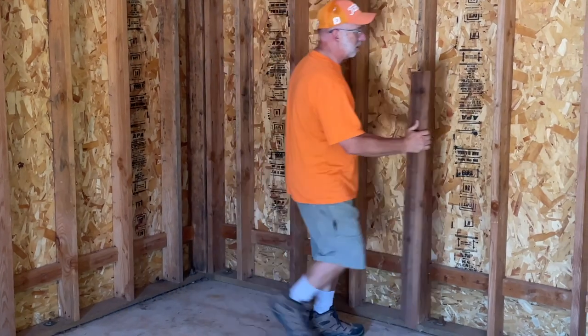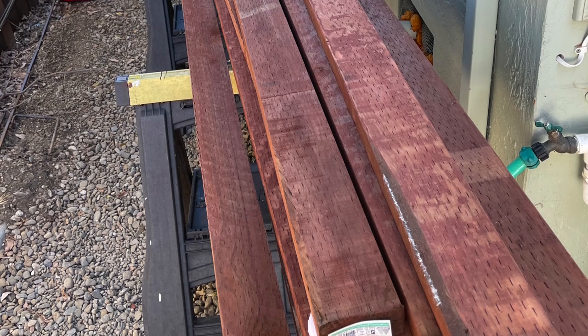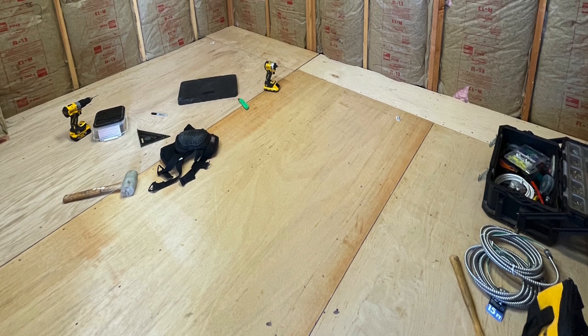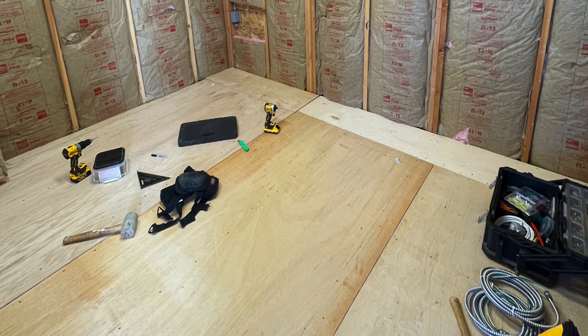The first thing I needed to do was to find a spot. If you're going to make your own YouTube studio, you can use a spare room or a garage, and the shell that I started with was a pretty raw space. It had concrete floors and no interior walls to speak of. The first thing I wanted to do was to control the sound, so I took two-by-fours on their sides and built a frame and set that on the floor, then laid down sheets of three-quarter inch plywood and screwed those all together — simply building a subfloor.